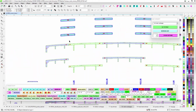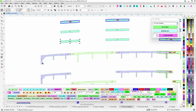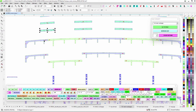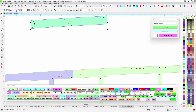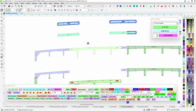The top is kind of like what we do. These jigs here go to the back side. You have your left and your left and your right and your right. That's as you look at it from the front. So this is your left side, this is your right side. And then you just push them back. So this side will always face forward, and then you just push the next one back. Like I say, these go to the back. They have cleco spots here to line up on the bottom. And then they also utilize random holes that will be there for the top skin.